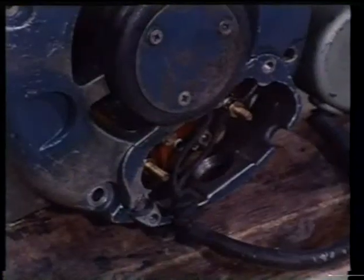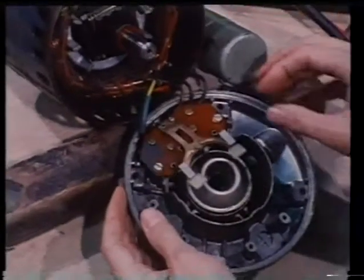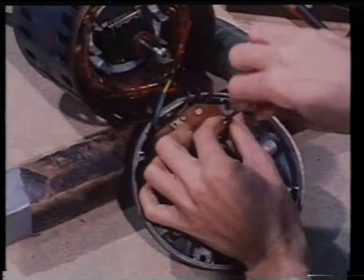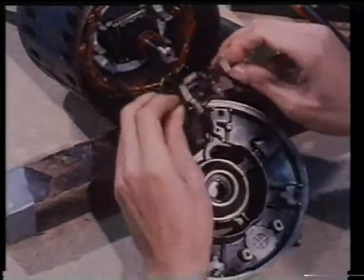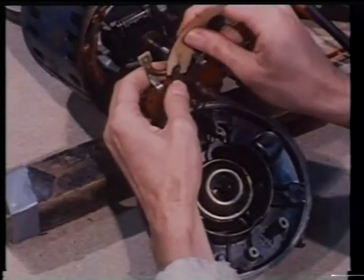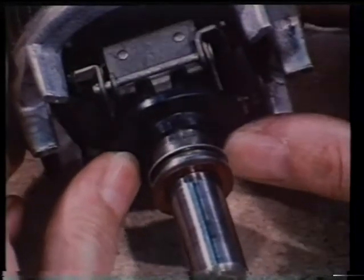Now, single-phase motors. We shall deal with two kinds: commutator and capacitor start types. If a breakdown or malfunction occurs with a single-phase motor, the test procedures described in connection with the three-phase machines also apply. The design features of a single-phase motor add one or two other procedures. For instance, the centrifugal switch contacts which disconnect the motor's start winding at full speed must be checked and cleaned, and the switch mechanism checked for easy movement.